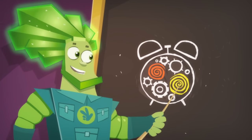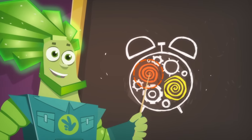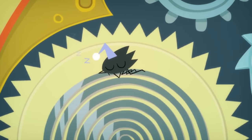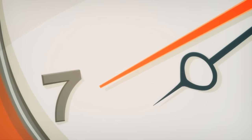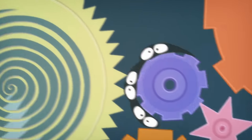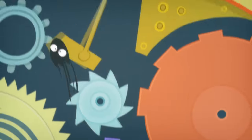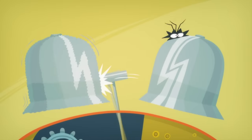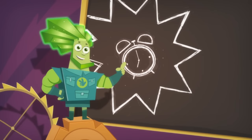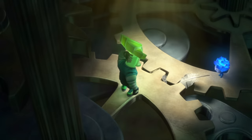Inside the clock, there is the mainspring, and there's also a second spring. The second spring is held still by a brake, and so it waits. When the little hand reaches the time the alarm was set to go off, the spring jumps off the brake, and the gears are free to start turning. That makes a little hammer beat the cup of a bell very, very quickly. And that's how an alarm clock rings.